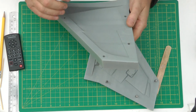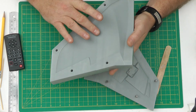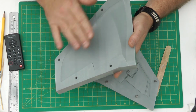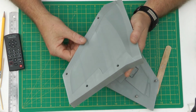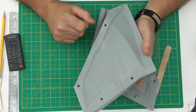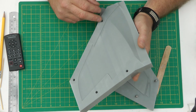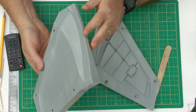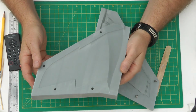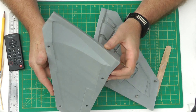And then with the top skin, to prep the mould again, very lightly wipe off any flashing. It lifts up really easy. Just be thorough, because the last thing you want is flashing falling into the mould. Make sure you get off all the edges and stuff as well. And that's just one light coat of the release agent.